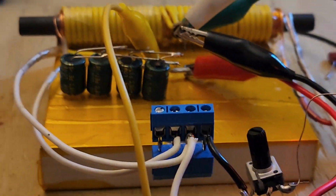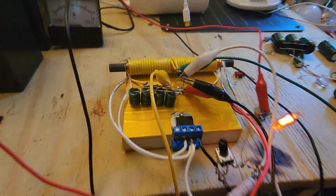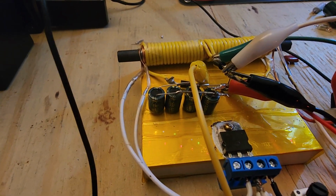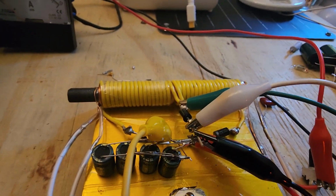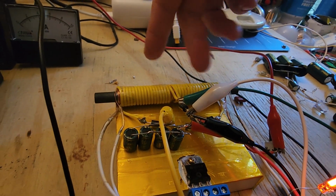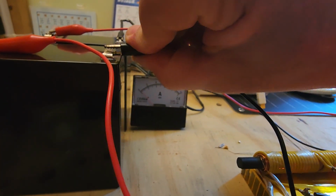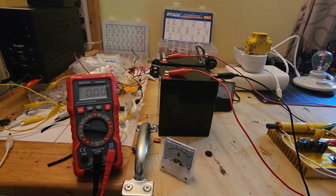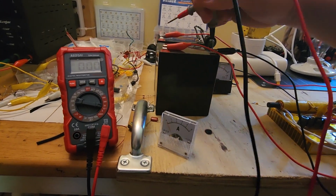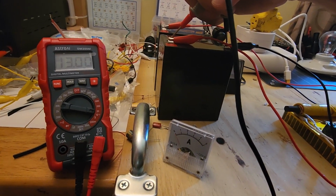In this design, I refined it a little more, eliminated the secondary pickup coil, added a tertiary wireless scavenging circuit here, isolated with capacitors, and got the correct DC capacitor value that was double the frequency of what we needed to avoid detuning. And basically what happens is this coil system, this one kicks out as this one kicks in, and it's like a punching effect, boom, boom, boom, boom, and we're so quickly able to recharge batteries, supercapacitors, whatever you want. And so just working out a few of the fine-tuning parameters of the device, and that'll say 13.01 any moment, because it was completely dead.